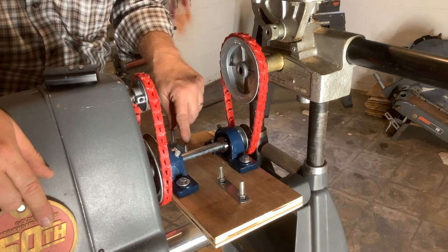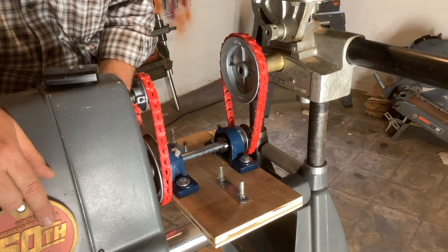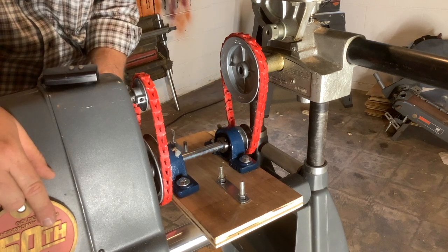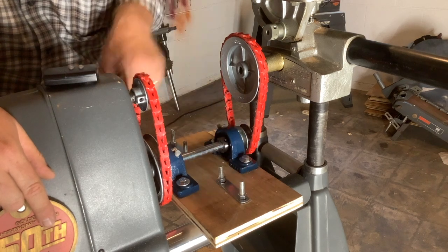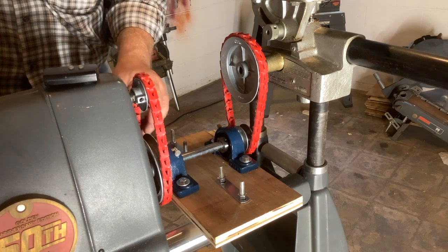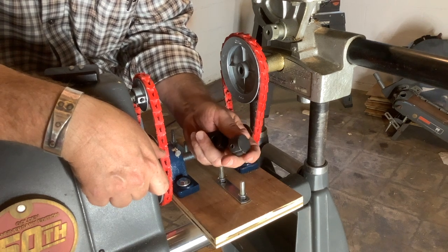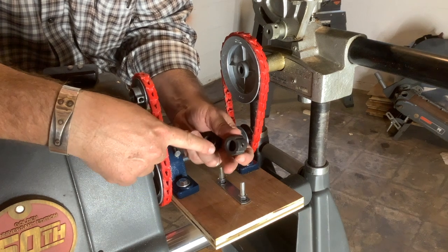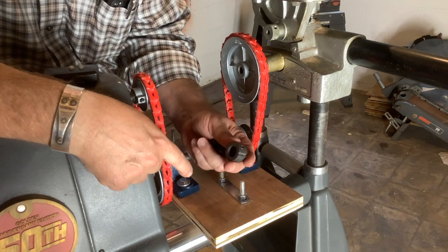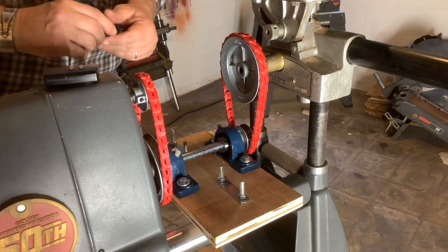On the front end I also have a U-bolt in the center, and in addition I've made a couple of little wooden blocks straddling the way tubes to provide a buffer from the end of the machine and to make sure I don't push the headstock all the way against this. The lower drive shaft is just spinning there and could come into contact with that pulley, so it's important to remove the drive hub normally used for powering high-speed devices like your jointer and scroll saw. As a side note, if you don't have this hub on your machine, I'd suggest you get one — it acts as a heat sink to draw heat away from that idler shaft and keeps those bearings nice and cool.